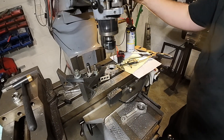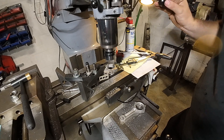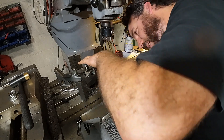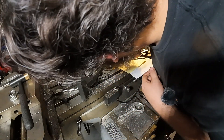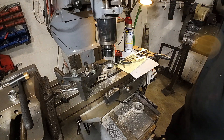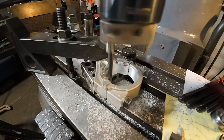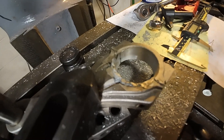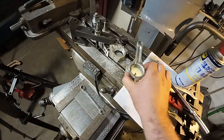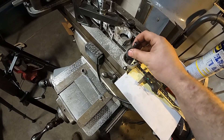We're back after welding. I'm just bringing the new welds down to match the old diameter, creeping up because I know I'm close. We're not there yet on size, but we might make it. One part of the rod is a little hairy, but the rest cleaned up good. I finished my final bore and it actually looks pretty good. This ugly stuff here is going away — remember this side of the rod gets a chamfer, so I'm going to grind a custom tool on a fly cutter to replicate this chamfer and cut it in there.